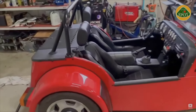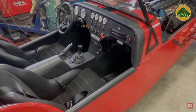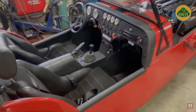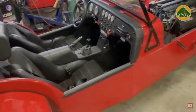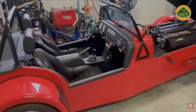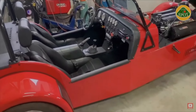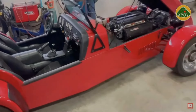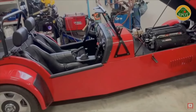Concerning the floor, I made mine out of aluminum and I made it in one piece. The reason I did that is just my concern over the structure of the frame — there's just not a whole lot down the center of the frame to keep it going from side to side. There's a lot of triangulation in the frame, but if you look down towards the floor, it's a box. It's not triangulated. So I made mine out of one piece and made it out of aluminum.